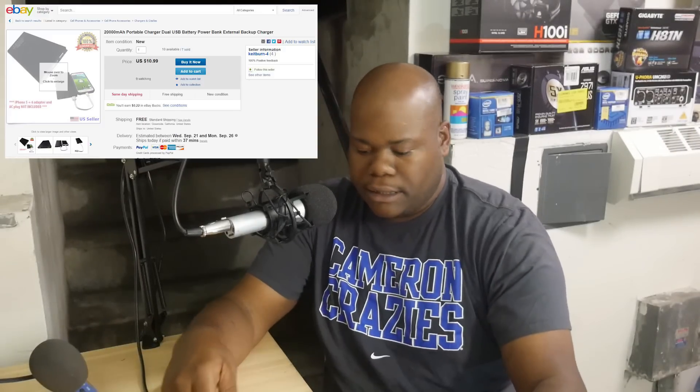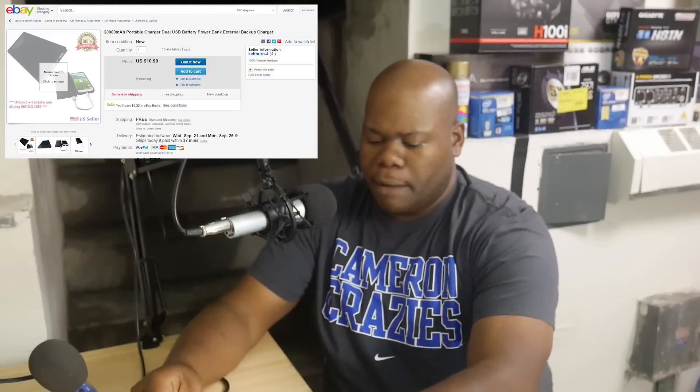I get about 20 hours of shooting with this. Pretty much everybody has a USB power bank at home, but if you don't, they're about 20 dollars — you can get them for as cheap as 10 bucks. The DC coupler for the Panasonic G7 or whatever your camera is was about 15 dollars from eBay. The 1.7mm to 2.5mm adapter was about 2 to 3 dollars, and the USB 5-volt to 9-volt DC adapter is about 5 dollars. That's basically a 20-dollar solution using stuff you already own.